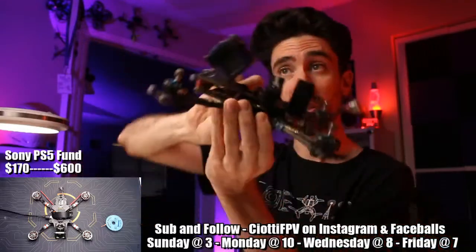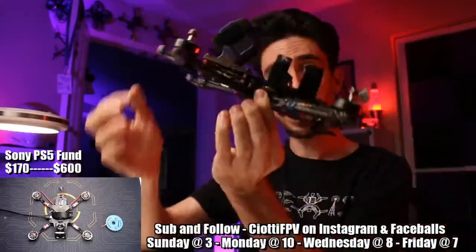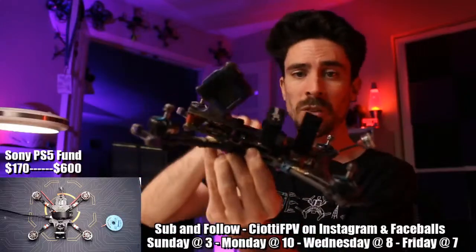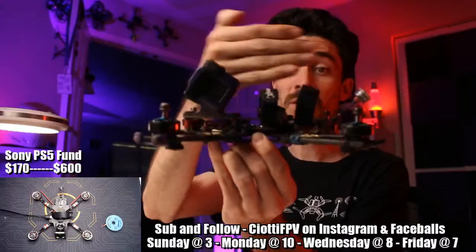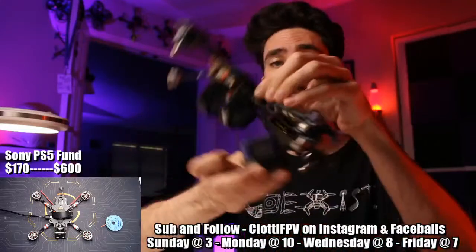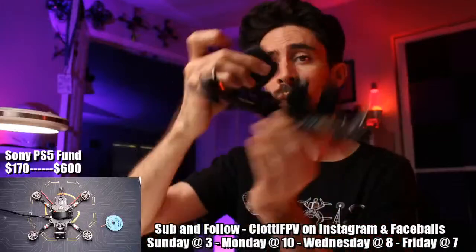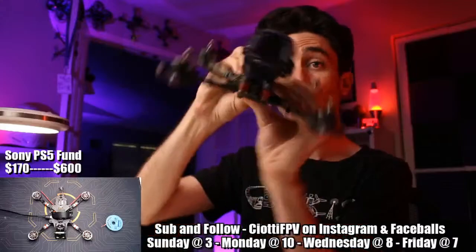So the pitch axis has to move all of the weight of that camera. See how that rotates around? That camera has to move in a totally different circle. And then the battery, to offset the weight of the camera, slides really far back. So the weight of the battery is shifted really far rearwards. So the amount of weight on the pitch axis of a 5-inch freestyle rig is very different than the amount of weight on the roll axis.